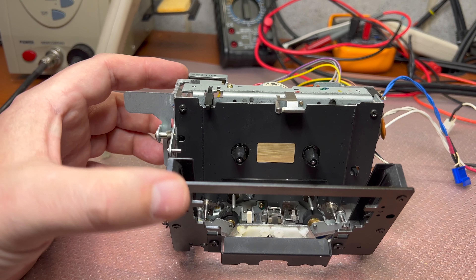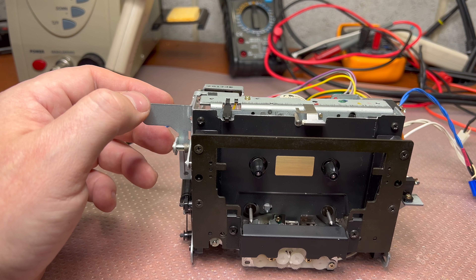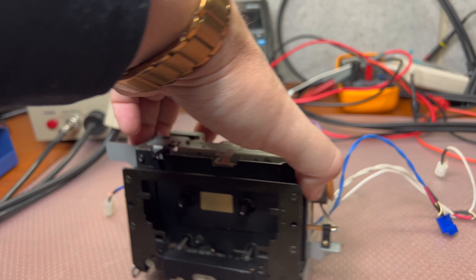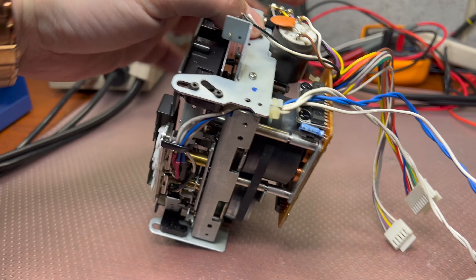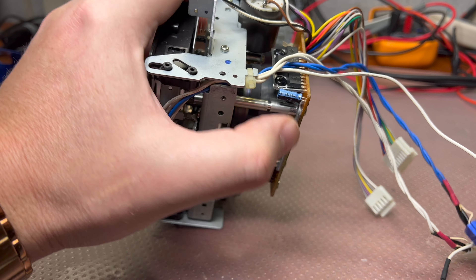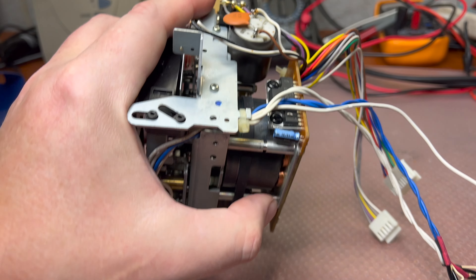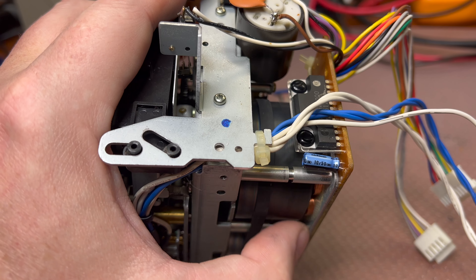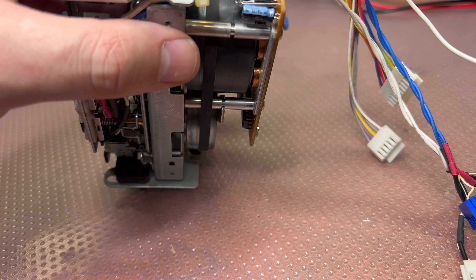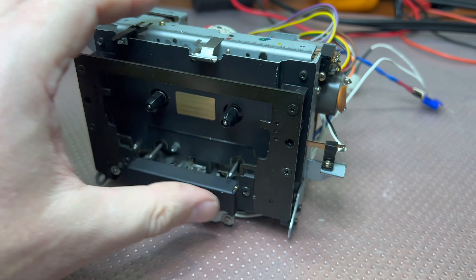Okay guys, and here is a new door installed — opens smoothly. Now it's time to assemble, start tuning, measuring parameters. I hope the wow and flutter will be good and won't be jumping like crazy. So there are no more problems I can see in this tape transport. Belt goes straight, no wobbling. Capacitor replaced as you may see. It should be good now. Let me connect and let's measure together.